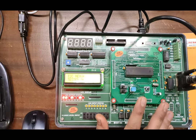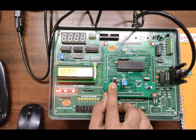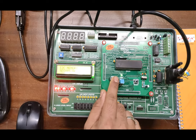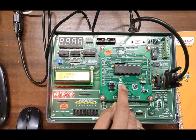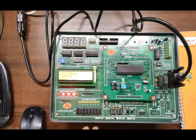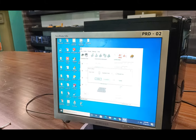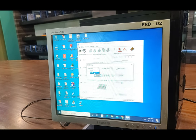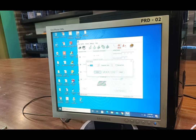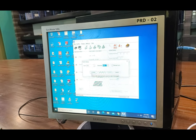On the daughterboard, make sure switch S4 and switch S5 are in the right position (right side), and switch S3 is in the ON position. The LED status will show whether it is on or off. Now press reset once, then press Connect in the software. Go back to the software — COM3 is our serial-to-USB COM port. Select COM port 3, set baud rate to 9600, and then press Connect.